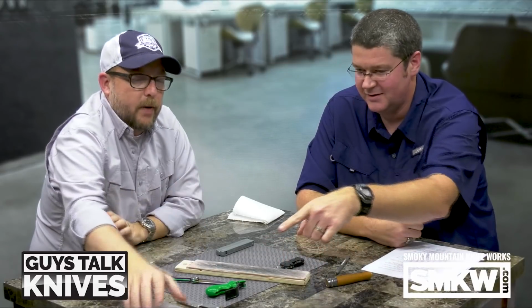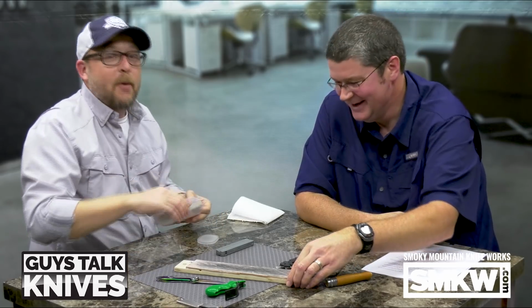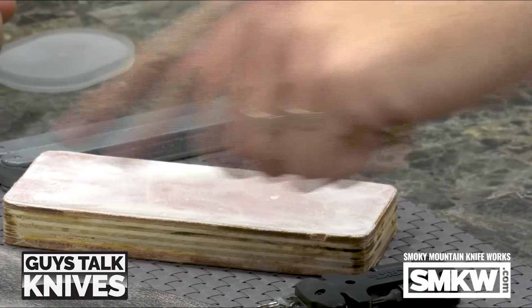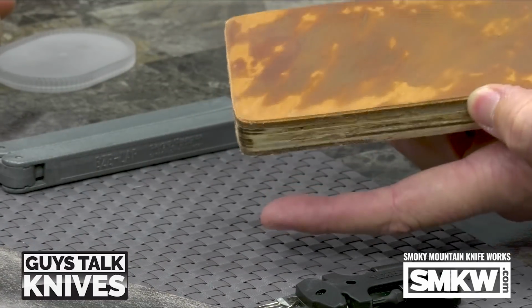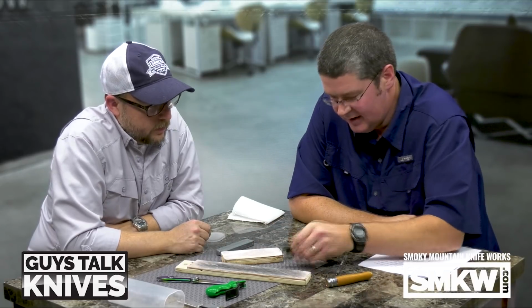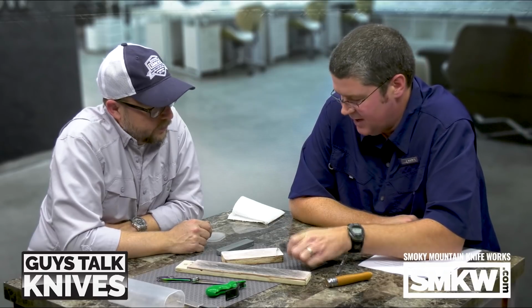These are a couple that I've made. And what strops is basically, and these are pretty much the same thing, it's just leather with an abrasive compound put onto it. You can have a coarse or medium strop, and then this is fine, which is basically metal polish. So at this point, you're literally polishing the edge to get that ultimate sharpness. Such as this one, you have the medium, then you have the ceramic fine. The ceramic fine will do this a little bit, but still I prefer strops.